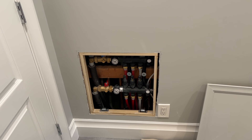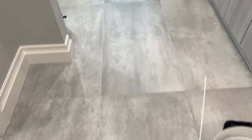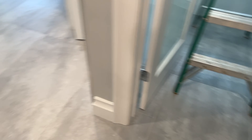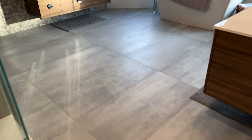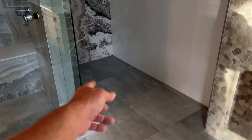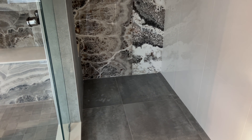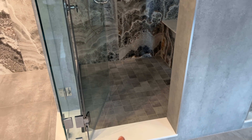Even got a nice little tub right there. We installed a Uponor hydronic radiant heating system to service this beautiful tile floor throughout — the water closet, main bathroom area, around the tub but not underneath, and inside this alcove. I really tried to convince my client to do radiant in the shower. He put in a custom fiberglass pan, but he didn't want to go with the radiant.